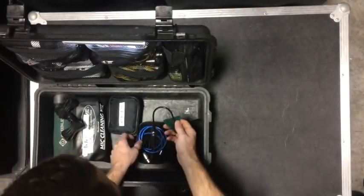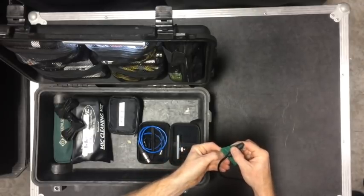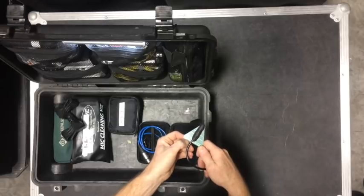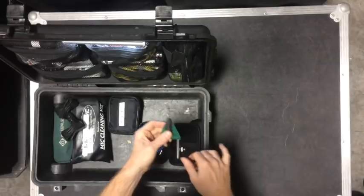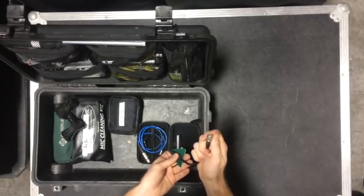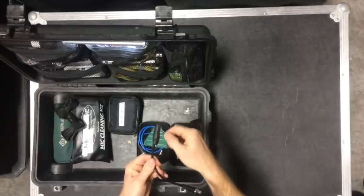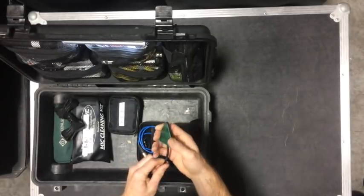I have an additional antenna — this is sold on WA5VJB's website; that's his callsign, he's a ham radio guy. This is the 2 to 11 gigahertz antenna, which I wired to a BNC to get onto the Line 6 receiver. I put a blob of Sugru on there to hold it in place. Should I need to get more distance — I rarely use it.